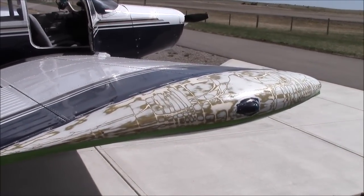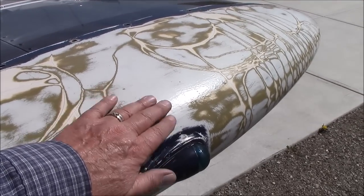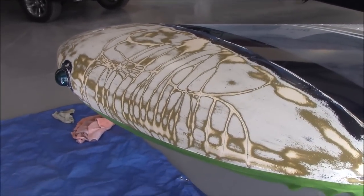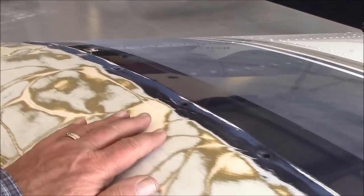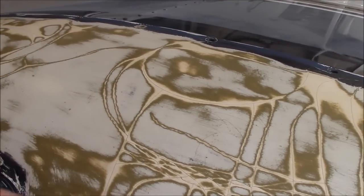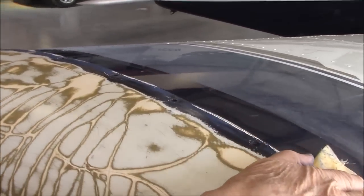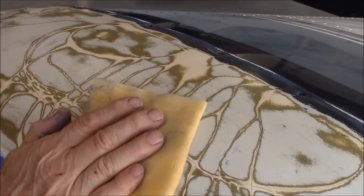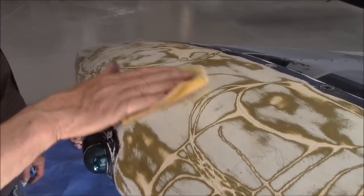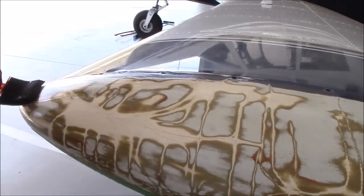That's what it looks like with the resin on it — there's quite a build-up of coating, you can see the reflection of the sun on it. We lightly sanded this area and now we're going to put another coat on top. It feels pretty smooth but there are still some lumps to sand out. Then we're going to take a tack rag — basically a tacky cheesecloth that's slightly damp — to remove the dust before the second coat goes on.